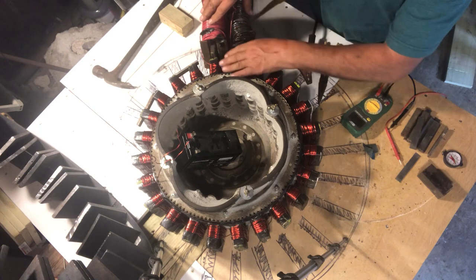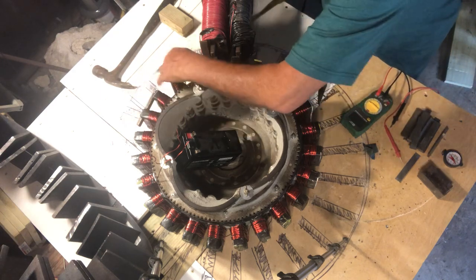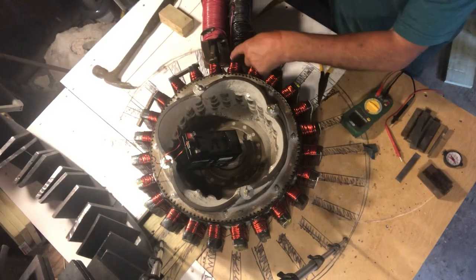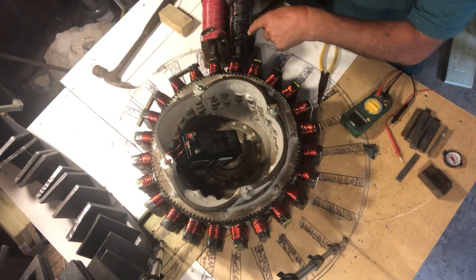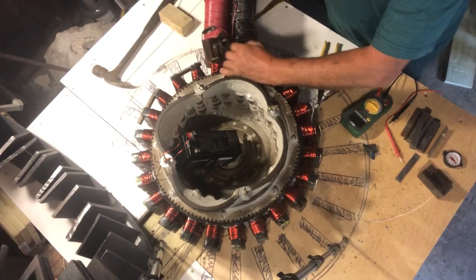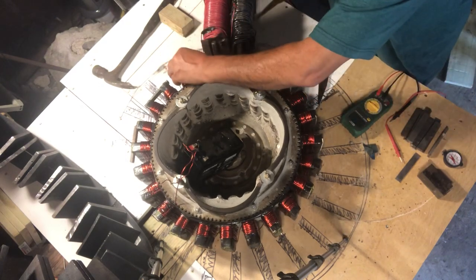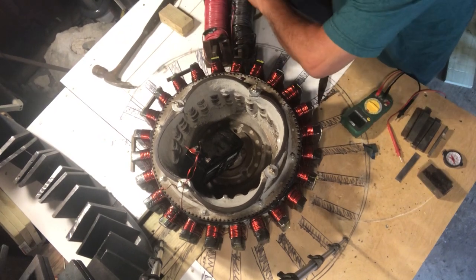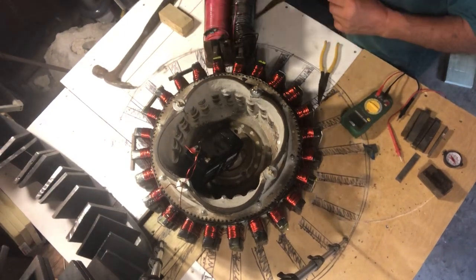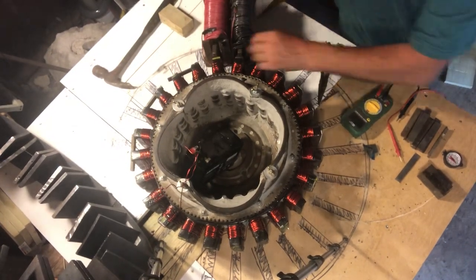Here's my PMH — I'm charging all these magnets right now at their maximum strength. I'll go ahead and demonstrate in front of you guys. Basically you just connect the PMH and send 24 volts into it. This side is north and this is south, so the opposite poles are facing inward. It charges just like that. Move the coils toward the front to give it more strength going into the iron — about 10 to 12 nice little jolts.